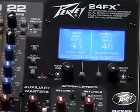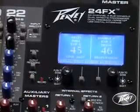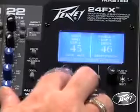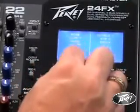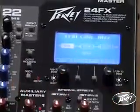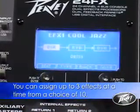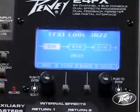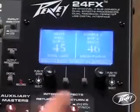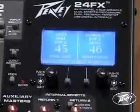The three modes are: FX mode, output processing, which I'll tell you more about in a minute, and digital input/output. The FX processing system consists of two multi-effects processors that are fully programmable and editable. You can run up to three effects at a time, pulling from a list of ten options, and each of the different types of effects is fully editable and programmable. There are two processors in the unit, which can be used on the two FX sends, or the second processor can be patched to an individual channel or to an individual subgroup.